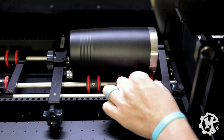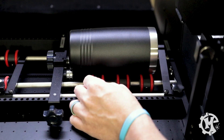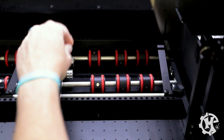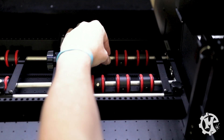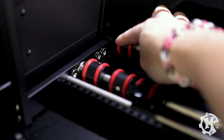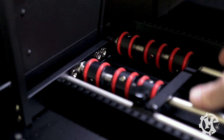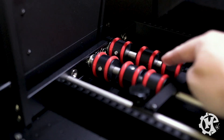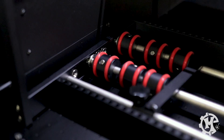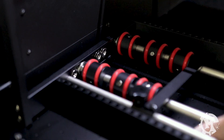For this cup I'm going to want a set of wheels near the front, probably another near the middle, and then the last one right about here. Once you have them lined up in the front, go to the back and make sure they're lined up there as well. An important part of the rotary attachment is that there are slots here — you can move these bars in and out. If you have something narrow you'll want them on the inside; if you have something with a larger diameter you'll want them on the outside. Do not mix and match — you either want both in or both out.